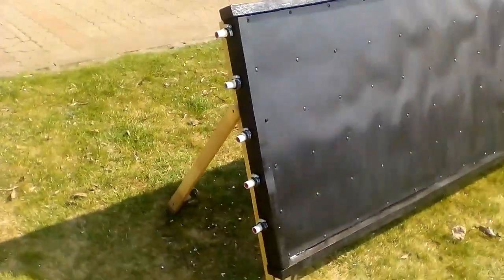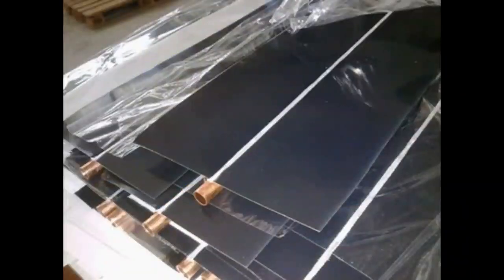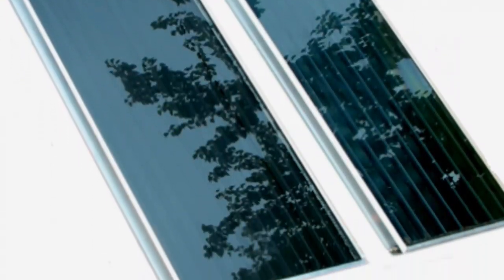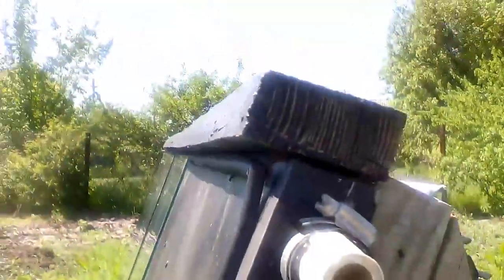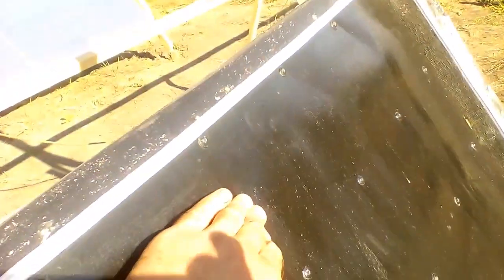Firstly, we can coat this steel sheet not with cheap black paint, but with a selective coating the same as that of expensive solar collectors. Secondly, we can use the special glass cover of expensive collectors instead of our cheap glass. Thirdly, we can use more efficient thermal insulation of the upper and lower walls of our collector and more efficient sealing of the air space between the glass and the steel sheet. If we use those three technical solutions, our solar collector has a slightly higher efficiency than expensive flat plate solar collectors because our water takes heat from almost the entire surface of the dark sheet, and therefore our efficiency does not depend on the thermal conductivity of the sheet, as was the case with expensive collectors.